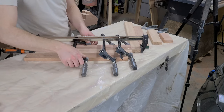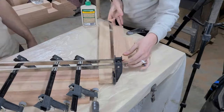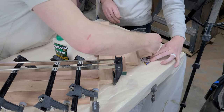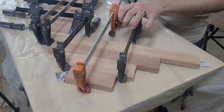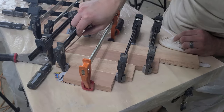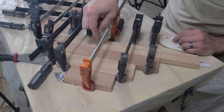We are putting this together on top of a wood table, so we have some plastic sheeting laid out to keep us from accidentally gluing our piece to the table. We aren't really worried about glue squeeze out at the bottom of this piece either because we are going to run the back side through the planer to get it down to its final size later. So now it's just a slow process of glue, clamp, and repeat. The sharp edges of this little ruler works pretty well to get into those chamfers and scrape out the large beads of glue.